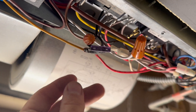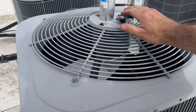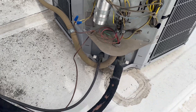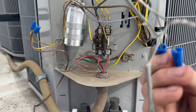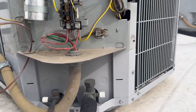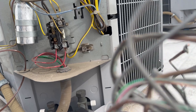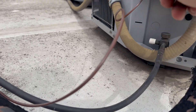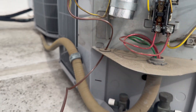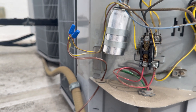Got that wrapped up. Let me show you why this popped in the first place. Here's our unit, cooling like a champ. So what happened — here's our old thermostat wire. You can see it's frayed in quite a lot of different spots. I ran all new thermostat wire on the roof. Look at that — there's a whole spot that's bare for several inches. This runs along this copper pipe, and when this yellow wire is energized and it hits against the copper pipe or its counterpart, the common, it's going to overheat that transformer and blow it.